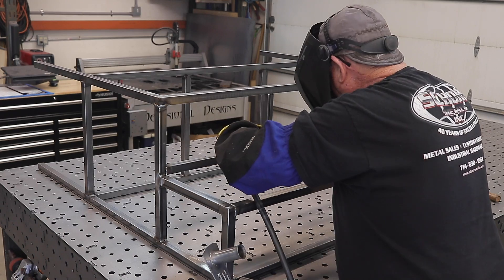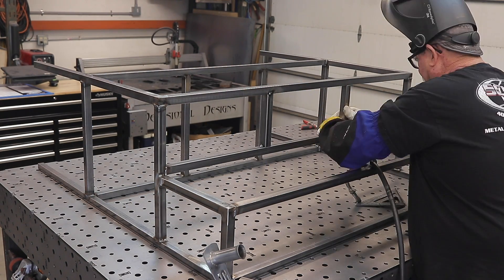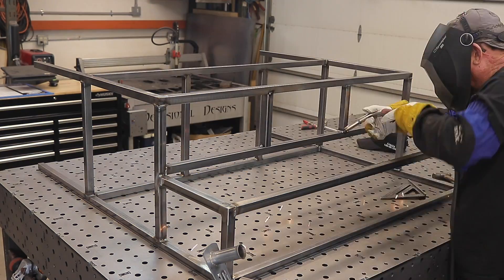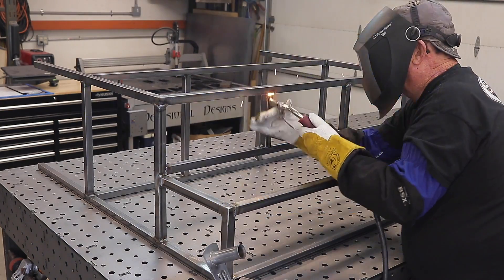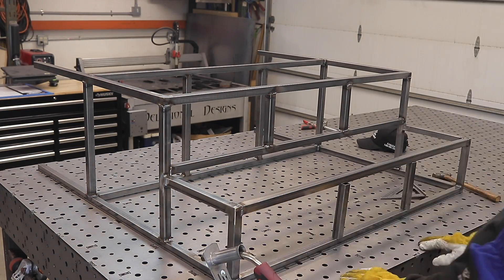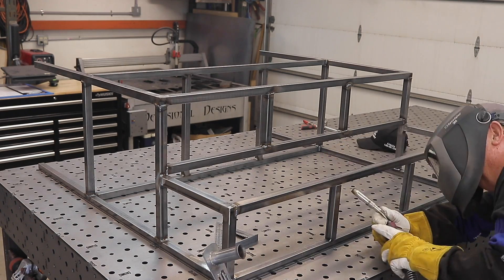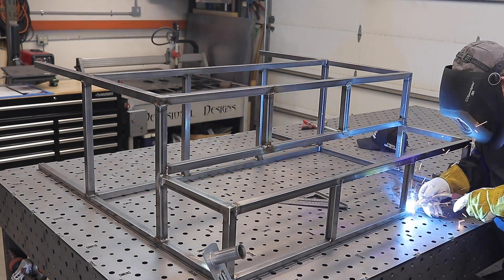I had to put in some little dividers between the shelves. I couldn't decide whether to put one or two, but I'm using some 14-gauge sheet metal — the same stuff I used on the bottom of the welding table and the ultimate welding cart. I had some left over, so I thought two dividers on each shelf plus the bottom shelf would be enough to support the sheet metal. There are probably a couple hundred welds here all the way around all these little tiny pieces; it takes a long time to get it all done.